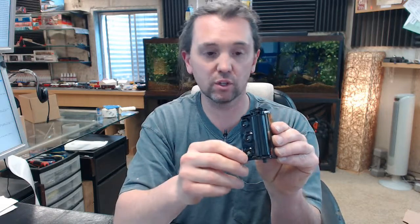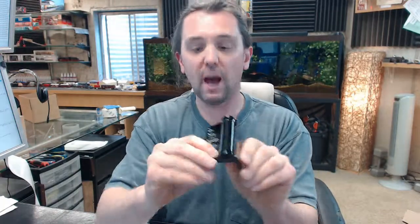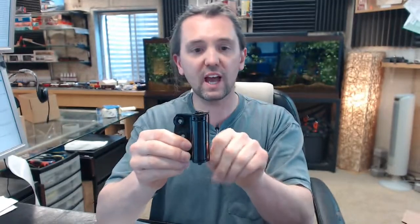Let's start at the beginning. 2930 means that it is a half surface hinge — that means the leaf attached to the door is surface mounted. The terminology of full surface, half surface, or half mortise refers to the door. If it is half something, it is half whatever it is to the door. In this case it is half surface, and that leaf is mounted to the door. What you are looking at here, from the perspective you are viewing it, would be as if you had a right hand reverse door.